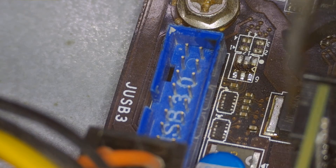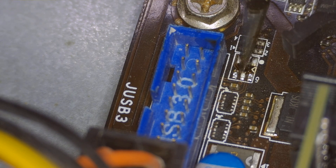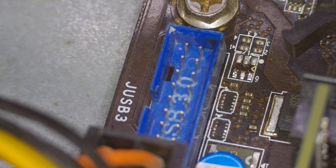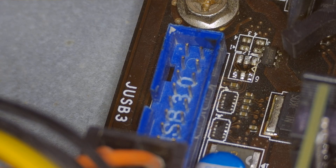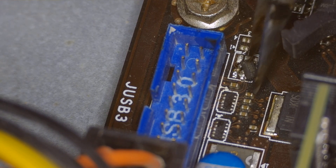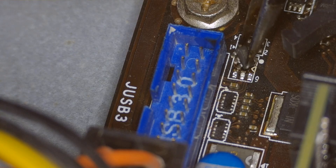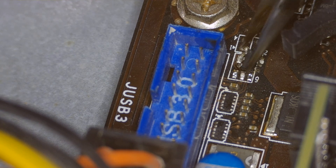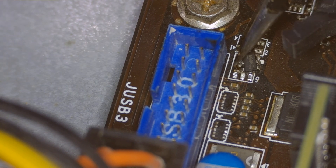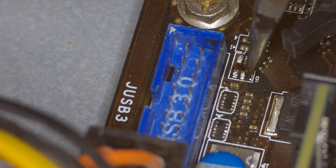This is the front 3.0 USB connector — I just removed this connector but the problem did not resolve. However, as soon as I removed this protection from here — I'll show you which protection it was — this was the protection on top. As soon as I removed this one, the overcurrent issue was resolved. I also tried removing protections at the back side of the board, but none of them had the issue. I'll show you in a moment in a normal view what the location of this one is.